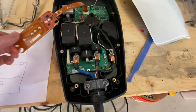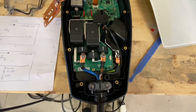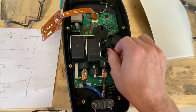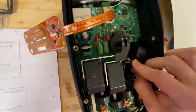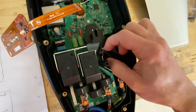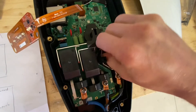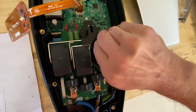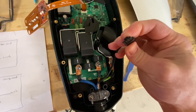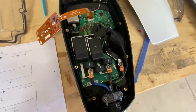So this is what it looks like from the factory. The Tesla cords are a little bit different — you can see it's got the two hots, the ground, and then this extra cable that has four different colors: orange, purple, blue, and white. I think if you have a Gen 2 charger, these are actually black or brown instead of white. This is a special kind of Molex connector. If you have the Gen 2 charger, I think it's just some screw terminals, which are a lot easier to work with.